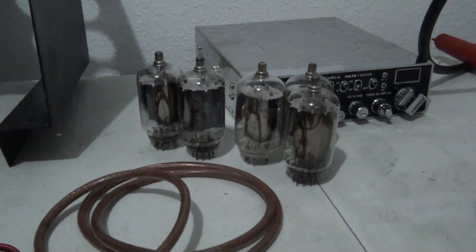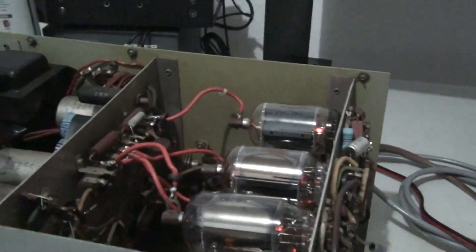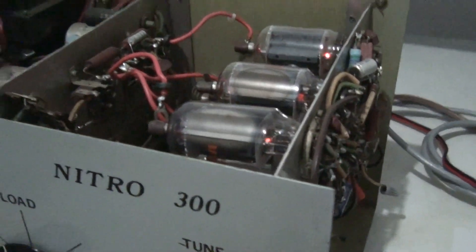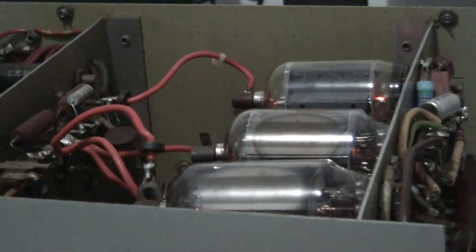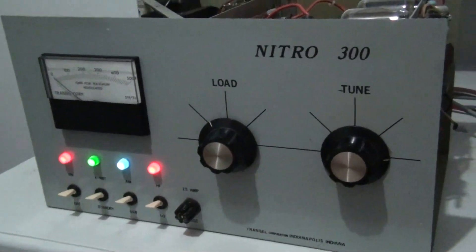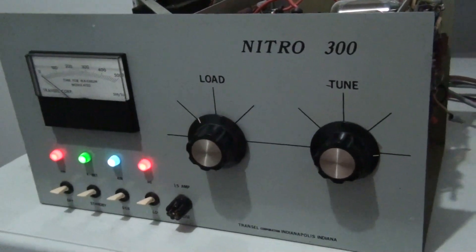There's five tubes there - the old tubes which were showing 500 something watts output, and the new tubes that are in it now. After I got it, I tested all the tubes in it and the driver tube was bad. It was showing extremely high input reflect and zero output, and it was all because of the driver tube.